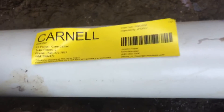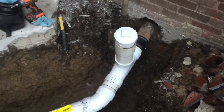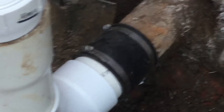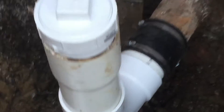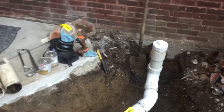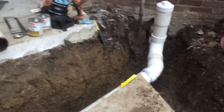We're here at 2260 Oxley and this is the first shot of the completed repair. You can see here that we have cut away that old hydraulic cement casing and Gorilla Tape patch that was there and replaced it with a new FernCo coming out to a 4-inch Y. And there's our clean-out. Now that clean-out's extra high so that whenever we do the patio back here, we'll be able to cut it down to the right height. So that's just temporary right there until that takes place, but it still functions fine.